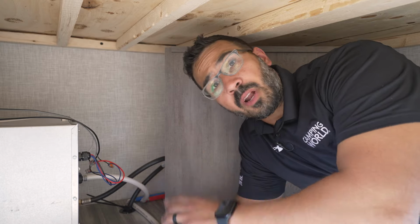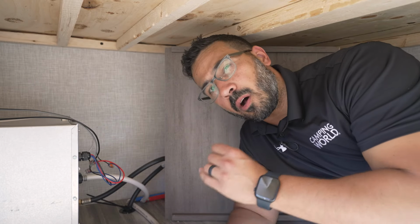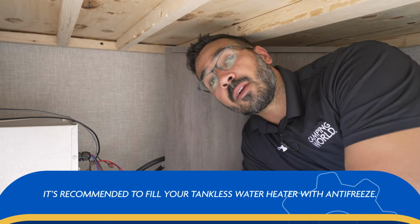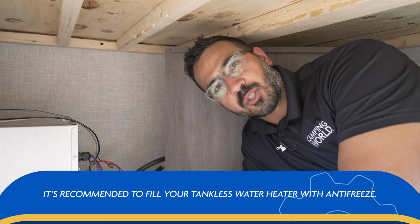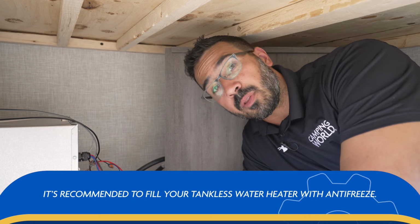It is your option whether or not you choose to bypass the water heater, but unlike traditional water heaters, it is actually highly recommended to fill your tankless water heater with antifreeze to help protect the heat exchanger, as the water does tend to get trapped in the coils.